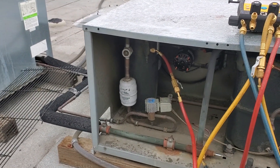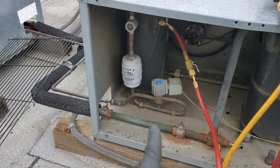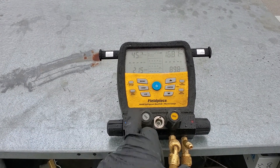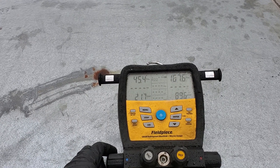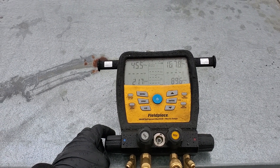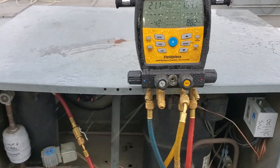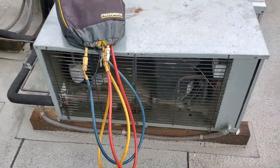I'm going to do a pump down test real quick because I did bring my heat producing device. We're going to check the liquid level. I'm waiting for this unit to pump down and satisfy. One thing I got to say — the Field Piece gauges have a really cool feature in that you don't have to worry about them getting wet at all. They are awesome for that reason. But this thing is not very promising right now because it is not pumping down. No bueno. Took a while, but yeah, this thing's definitely got a weak compressor. It's not sounding very good either.